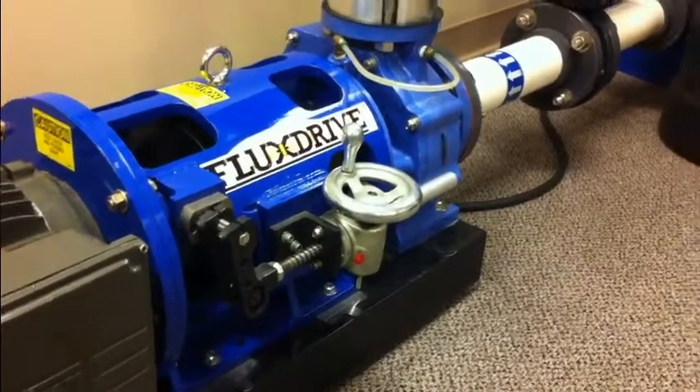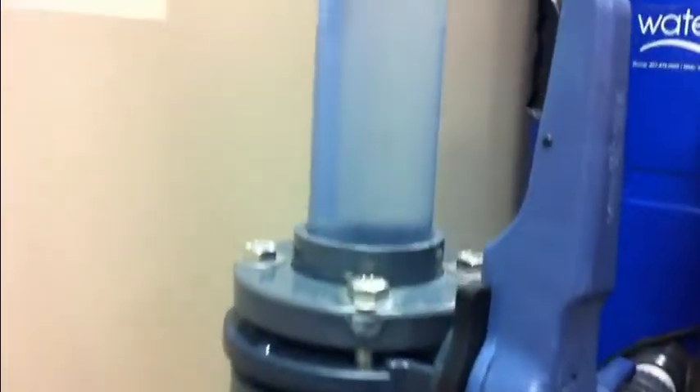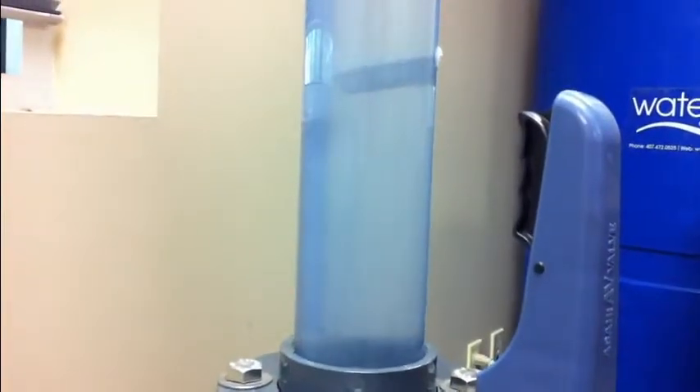In addition, because this pump is oversized for the load, you can hear and see cavitation which can cause long-term damage to the pump.